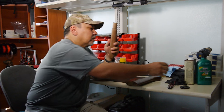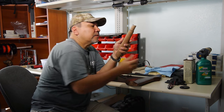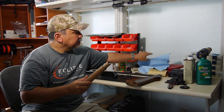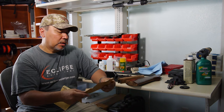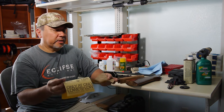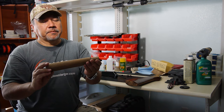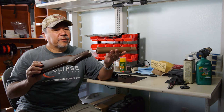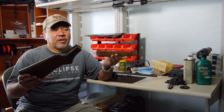What I did, I took some furniture refinisher to take off all the old stuff. And then I was using 220 and 400 grit sandpaper to sand the rest of this off, and it actually turned out pretty good. But the thing is, two different types of wood — so no matter what I do, they're going to look different.